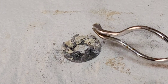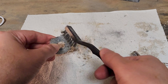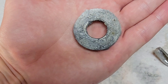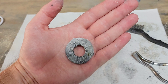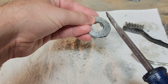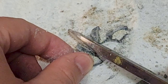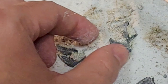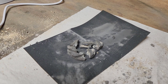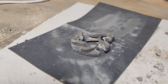This first piece is a noticeably different color than the prior flux-only impellers, and at first inspection appears to be stronger, but I wouldn't call it functional quite yet. I also followed up with a second sinter of the other piece, and the results were better, but still brittle. So, I think what this means is that I need to do a little bit more research.